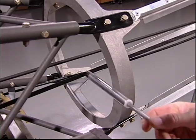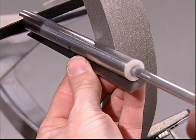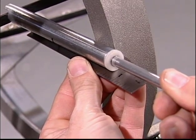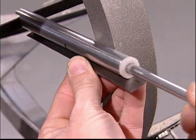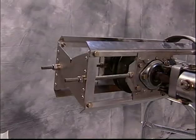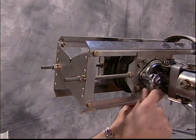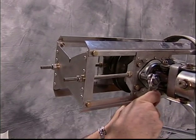Verify the belt tension at the first bulkhead. The proper tension should deflect the belt 1 3/8 inch with 10 pounds of pressure from the tensioning tool. When the belts are at the correct tension, retighten the 1/4-inch bearing flange bolts and tighten the jam nuts on the all-threaded rod.